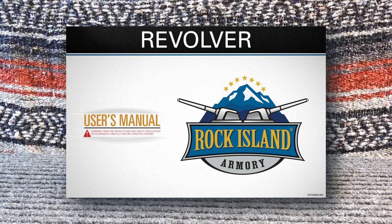After cleaning the gun with solvent, remove all traces of the solvent and apply a light film of oil immediately thereafter. It is normal to find residues in the barrel and cylinder within 24 to 48 hours after initial cleaning. These can be removed with a bristle brush and a slight reapplication of solvent, after which slight oil should be reapplied on all surfaces.